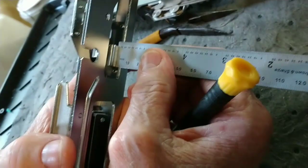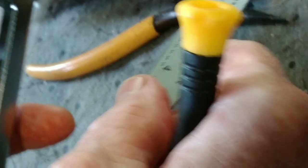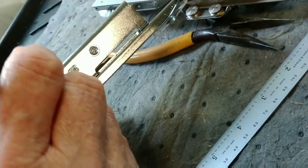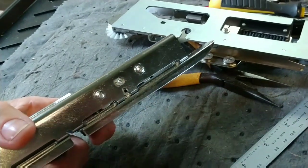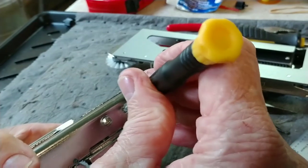Here I've made the adjustment on the bad one to show you that it's now four millimeters away from the top surface here to the top surface of that silver cam. And that's what our good one measured — also four millimeters. So now we go right here on the back, and we want to snug. You'll notice I'm using a flat screwdriver on this cross point so that I know I'm not over-torquing it. I can get in there, and now I've snugged it up so it cannot move.